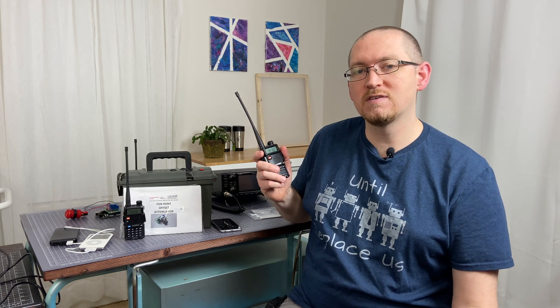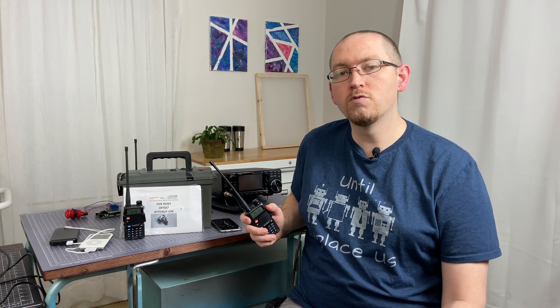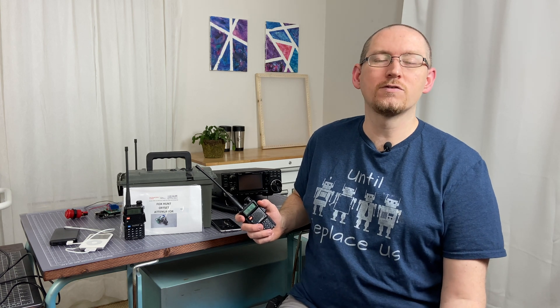It's really truly as simple as that. If you find that when you're playing your file back through the radio it's cutting in and out, it may be because the signal strength coming out of your MP3 player or your phone just isn't quite strong enough to activate the VOX. You could try two things: one, lower the VOX setting down to one or two. Alternatively, you could re-record your message at a higher level — just speak more loudly into the microphone. Even if it becomes over-modulated, it'll still be understandable and you'll still be able to use it.